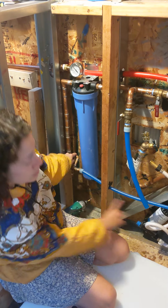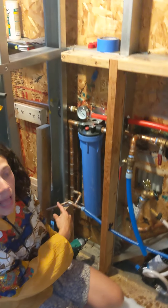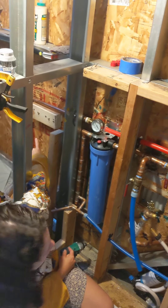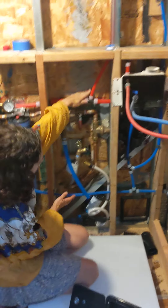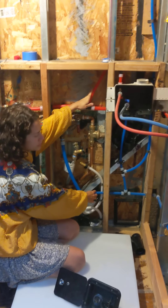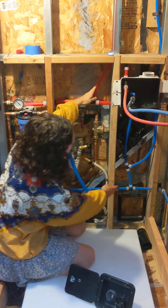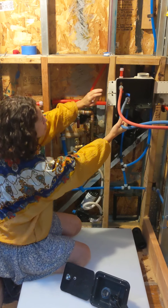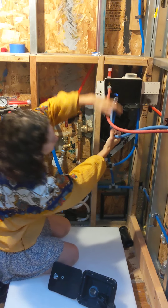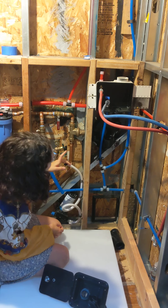The cold water splits right here — the rest of the cold water system goes this way for all the cold lines, and then it dips under and goes the other way to the hot water heater located right here. From there it becomes hot water, transitions into PEX, and I've got my hot lines and cold lines running to all my utilities. I've got a cold line here to my laundry and a hot line down here to my washer/dryer combo unit.